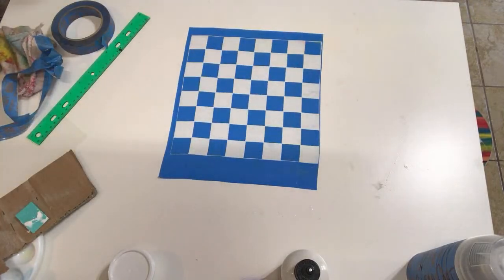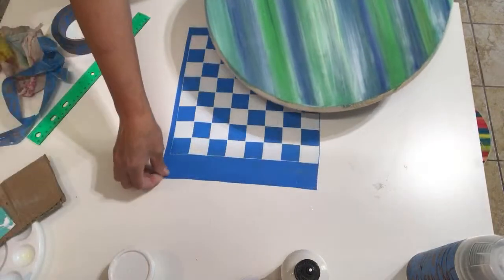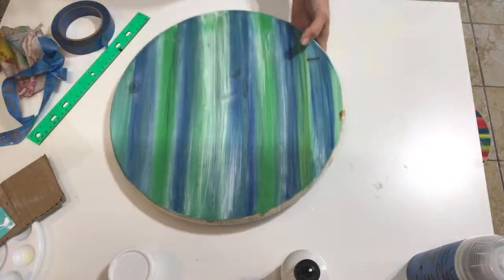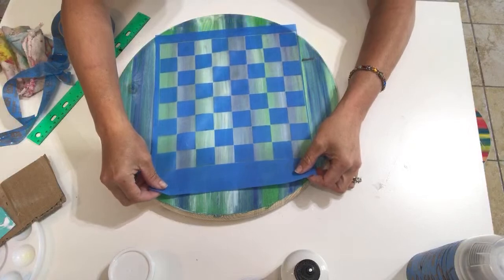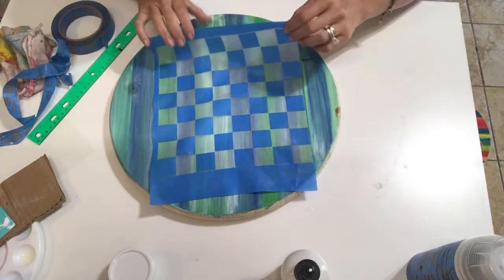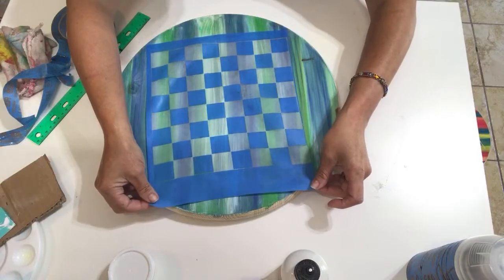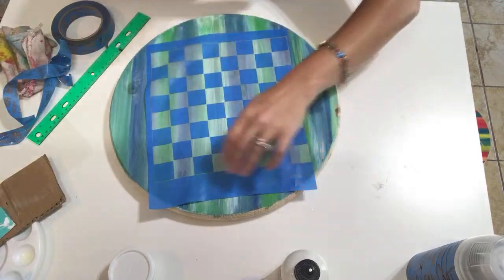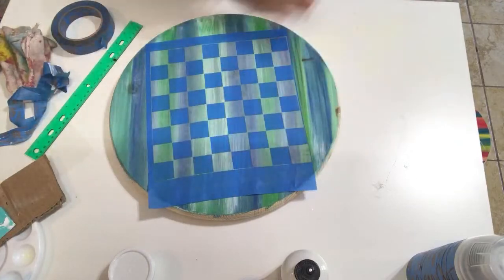Now this second piece that I have is actually sealed already. I did this one yesterday with you guys, and I've already sealed this one, and I've already knocked down any of the little fibrous things that are sticking through. And we're just gonna take the stencil, yes, even though it is damp, put it sticky side down, and we're gonna be able to use this stencil immediately again without having to wait for it to dry 100%. You just gotta make sure that we got it leveled up, and the dampness of it helps significantly with it adhering to that sealed surface too.